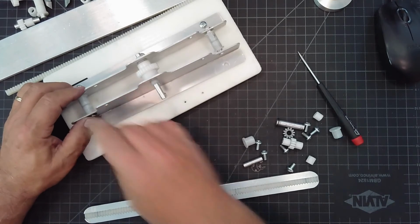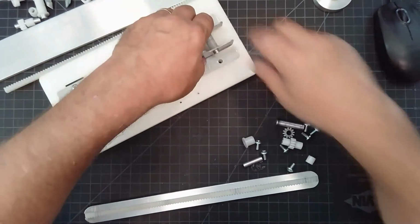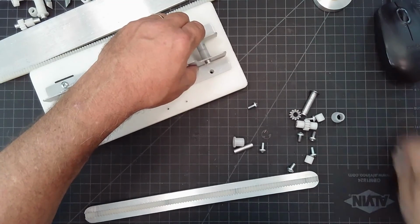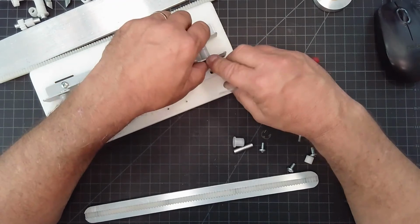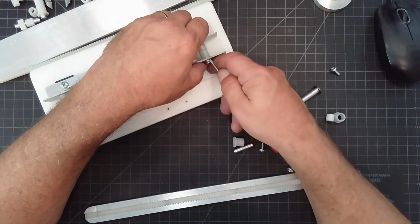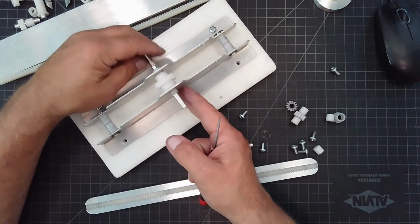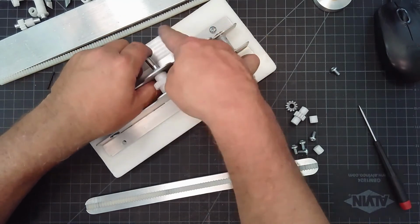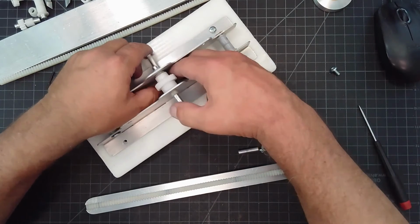And here we go. Here's one. Here's another. And while we're doing this, I'll probably put that 3rd one in. So all the while when you're designing these, the ultimate thing to keep in mind is that relationship between the pinion gear and the rack itself, right? It's right in the name of the device, rack and pinion. So they're real important that their relationship is such. So I'm going to put my bushings in down here. A little tricky, takes a little dexterity.